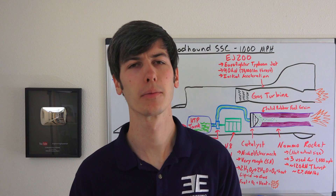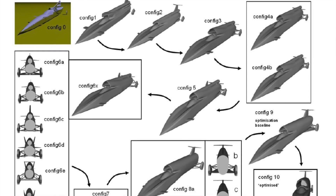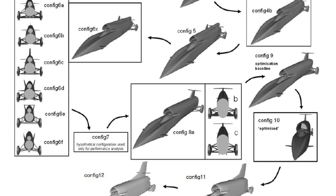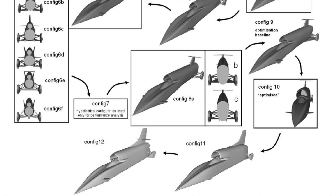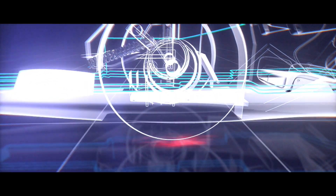How do you prevent the car from lifting? The overall shape is designed to minimize lift, though you can almost never eliminate it completely. You don't want upward-facing features on the front nor downward-facing features on the rear, as these create lift. The design aims for one metric ton of lift between the front and rear axle, meaning the car will still have over 6 tons weighing it down. There are also winglets up front to adjust for lift.